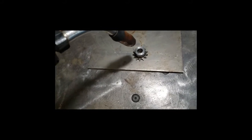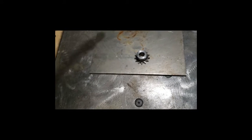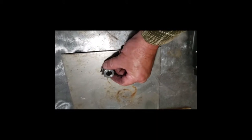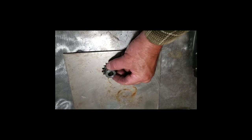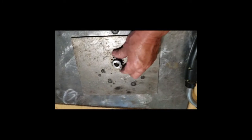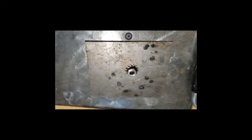I'm going to put my amps on 200 and put my wire feed up pretty high — on my machine it's a value of 6. I'm going to fill that up with weld. Before I do that, I usually run a cutter through the hole if it's worn out, because of scrap metals, oils — to get all the junk out and clean the hole. But this is a new sprocket, so I'm not going to do that. I'm just going to weld it up solid. I did wash it with lacquer thinner and cleaned off my aluminum plate — works pretty well.